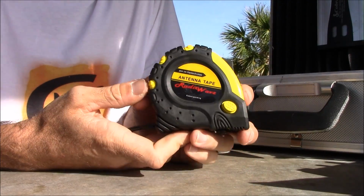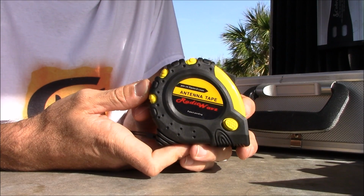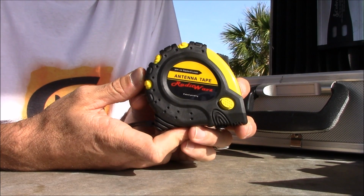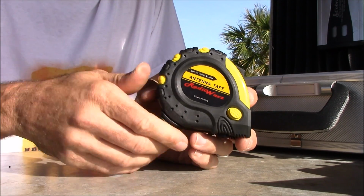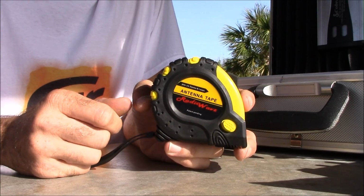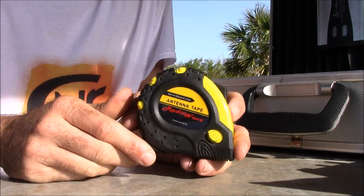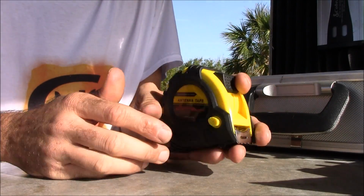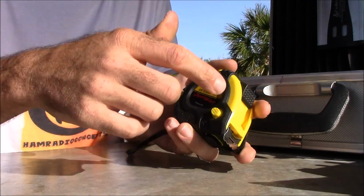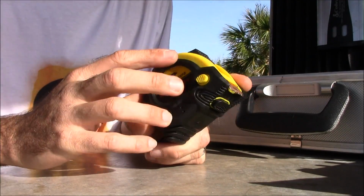Now Jan was with me, and he had a counterpoise today from another kind of unit, and he said the adjustable portable counterpoise and the other unit was $200. And so I said, why not just use this? I pull out the recommended 180 divided by frequency equals length, and then I just clip it right to the radio, as you'll see, and there's my counterpoise. It fits right in the box nicely.